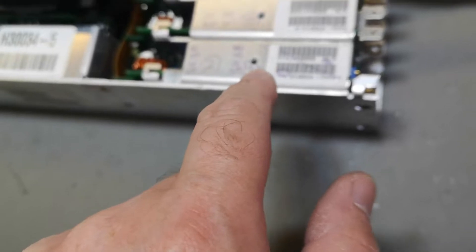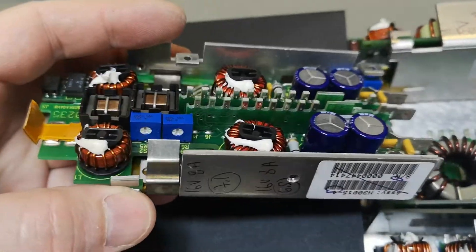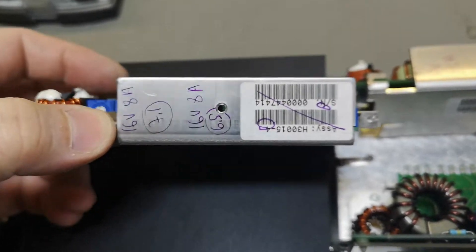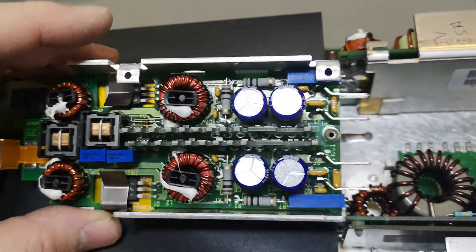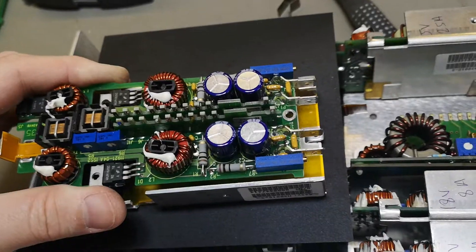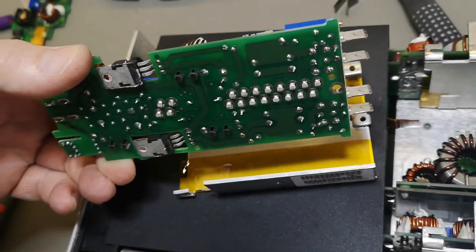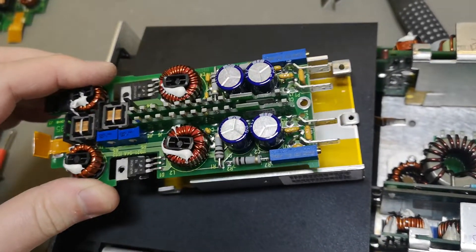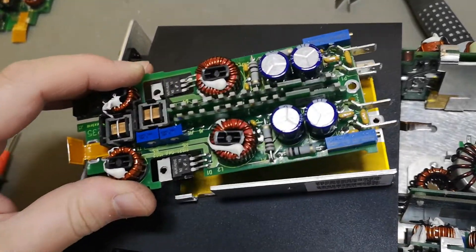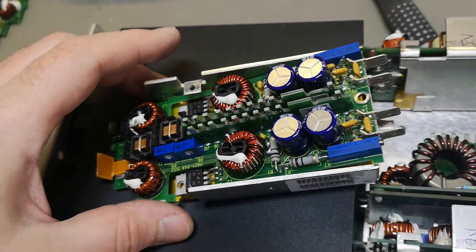Then we've got this one which is clearly dead. This is quite easy — just cut the windings. I know this is totally vandalism, but the module doesn't work anyway. This one was supposed to be double 16 volts but is only doing half. Let me guess: dead diodes again. One simple screw, flip-flap, and out we go. I really hate to admit it but those guys are just geniuses. This takes like a second to assemble and a second to disassemble — one simple screw and it all locks in.